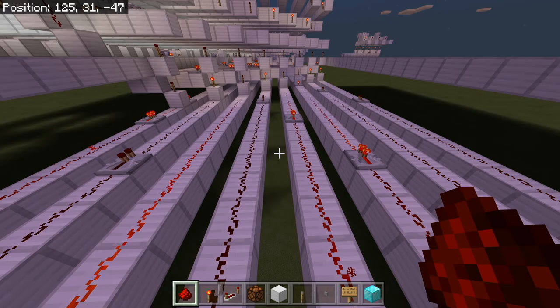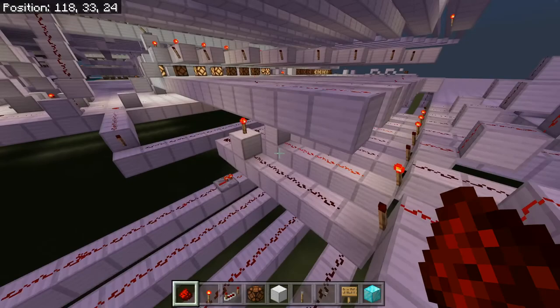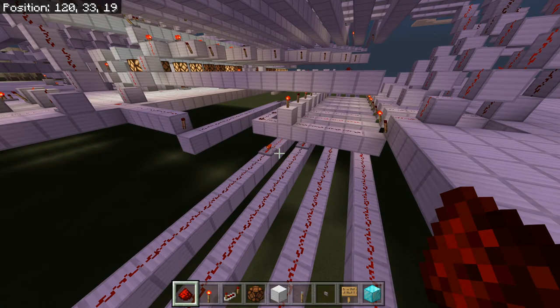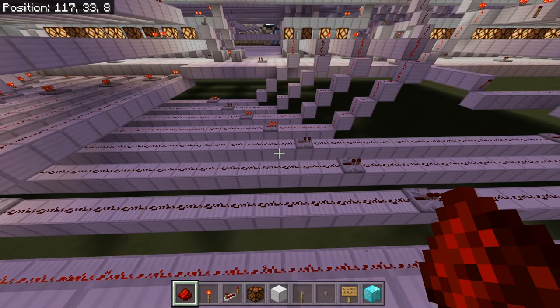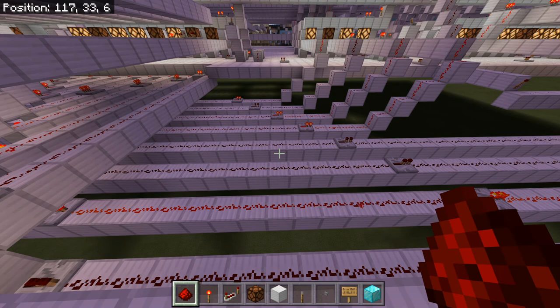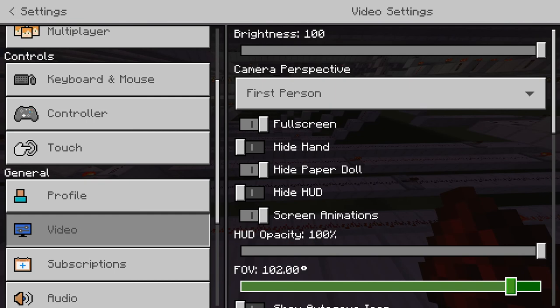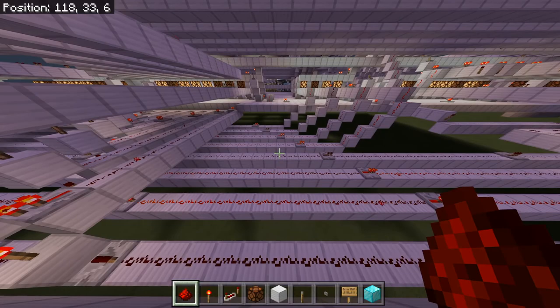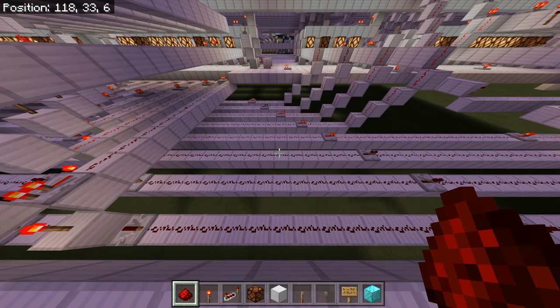And then what I'm anxious to see is whether the increment is finishing before the next program counter update comes along, so before the next clock edge. All of these should have been done updating before I see the next negative edge of the clock. That's really fine at the moment if we watch. So let me increase the field of view just a little bit, so the clock edge is there and there, and then the clock edge. Increment and the clock edge. So it's really fine at the moment.